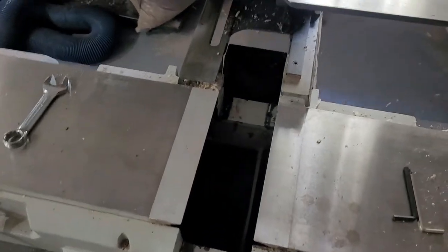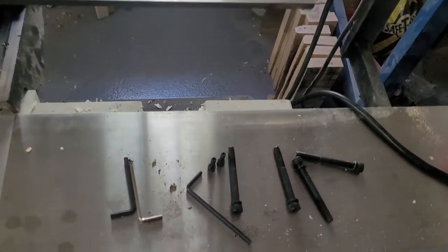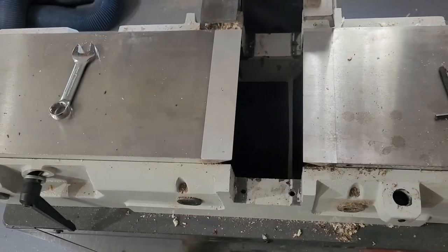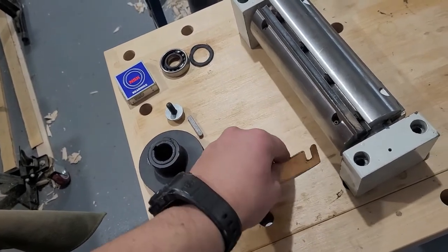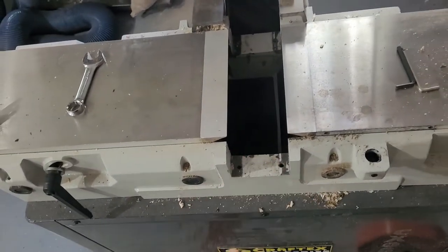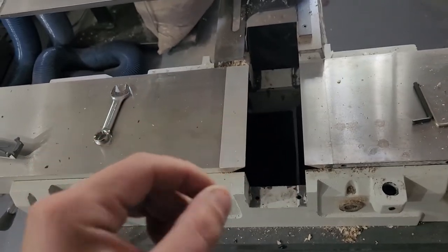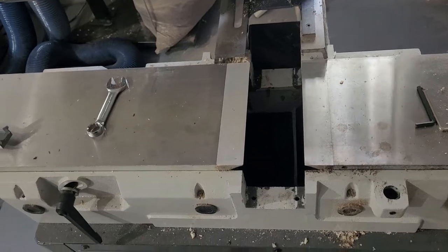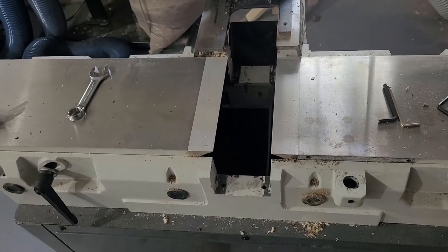The cutter head is pretty simple when you take it out — it's held on by four long bolts right here. Just Allen key, you unscrew them, they come out with little washers, so just be careful not to lose those. One thing to be very, very cautious of when you're lifting the cutter head out of the jointer is that you could have these tiny little shims — there are like four or five in this little pile here. These were on the outside of my jointer just underneath the cutter head, so as I lifted it up I pulled them out and set them off to the side. You don't want to lose those. Keep in mind how many you have and where, because not all jointers may be manufactured the same — that's why they use shims to make sure everything is level. When I got this back in May, everything was level right out of the box with zero fiddling. So whenever you take that apart, be careful not to lose the shims.